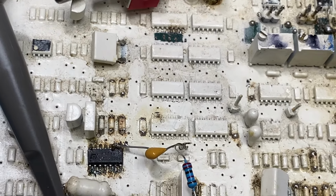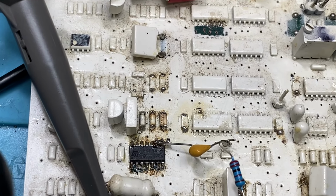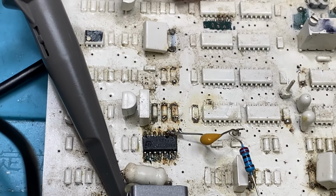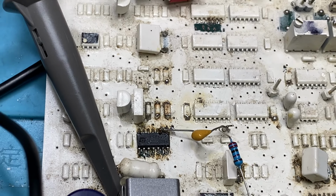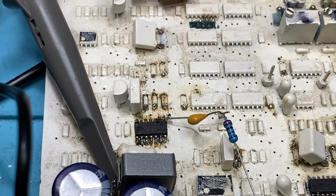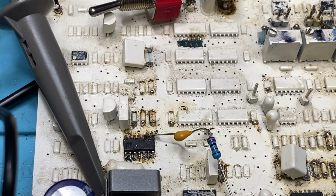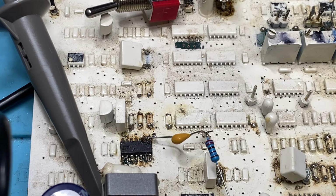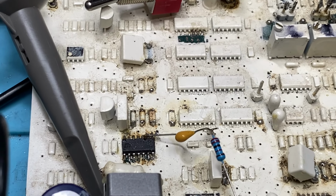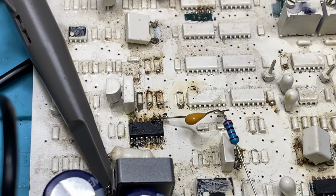But, yeah, what you've got to do is get your soldering iron in there and a very, very fine tool, like a little tiny jeweler screwdriver, and just bend that leg up in the air off the solder pad and just isolate it off the board. So it's pin 9. If you go in the front where I'm looking at the moment, it goes 1, 2, 3, 4, 5, 6, 7, 8, basically left to right, and then right to left on the top. So then it goes 1, 2, 3, 4, 5, 6, 7, 8, then 9, right? So second one on the top in is 9. That's the way you do the chip numbering.